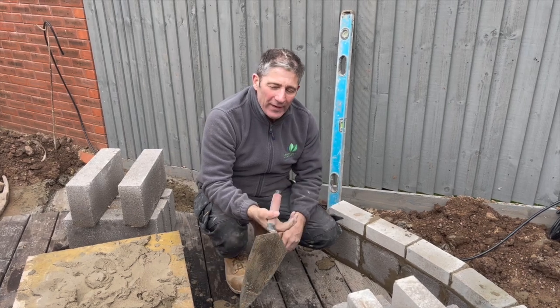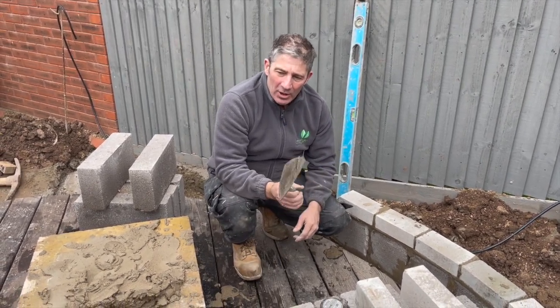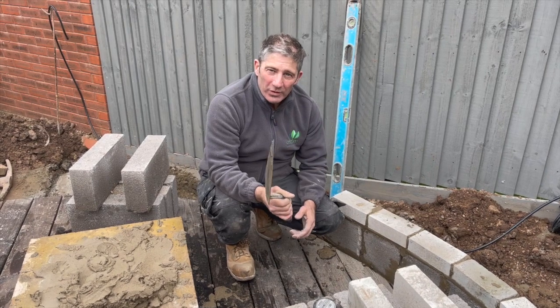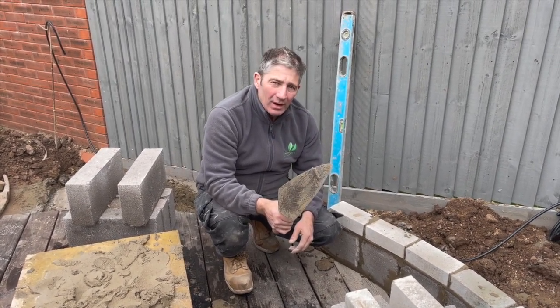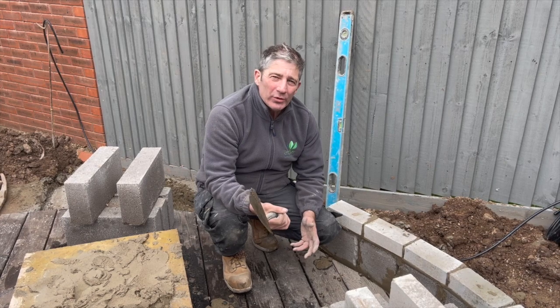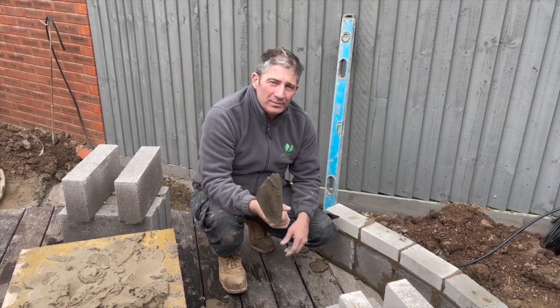We've got so many tools available to us these days compared to what we had in the past. But that TC125 is a brilliant saw, and it's a track saw as well, isn't it? It is, yeah, it is a track saw. What's the beauty of running things on a track saw? It's just one continuous straight line. You can't mess up, you can't be a mil out here, 2 mils out there. We're cutting through 20 mil porcelain, aren't we? Yeah. And how many passes should we have? It's definitely going to be a few passes.